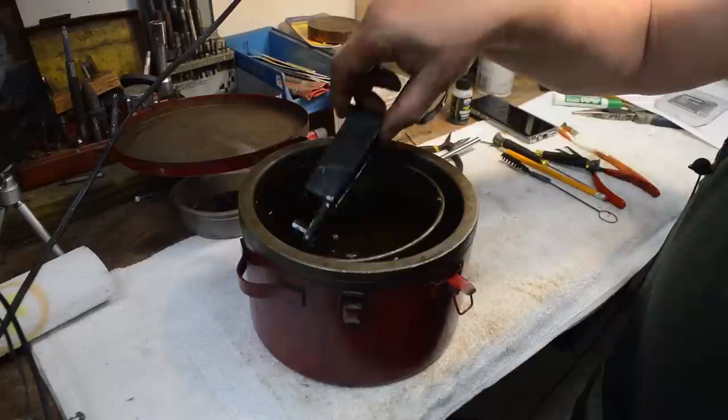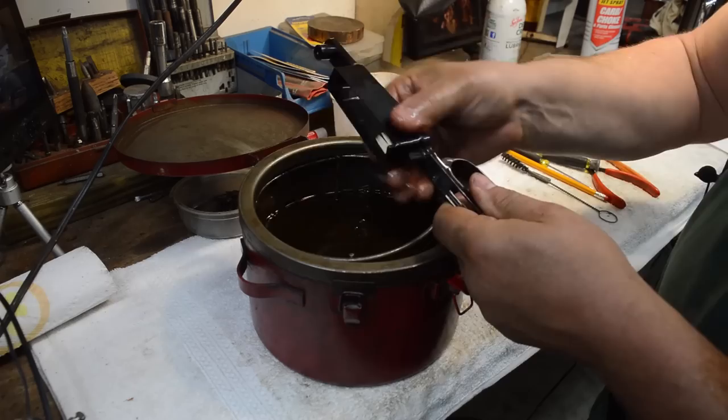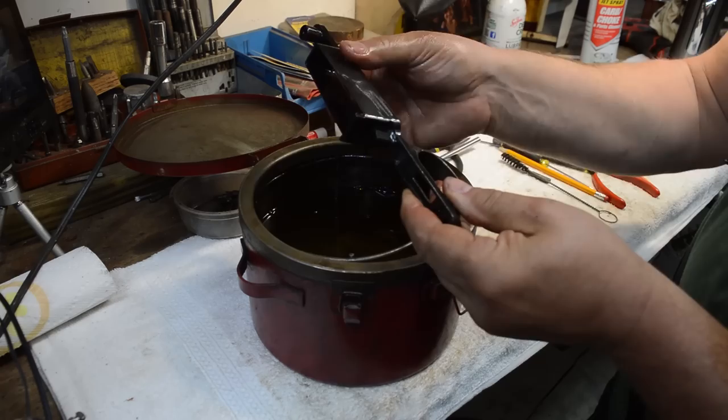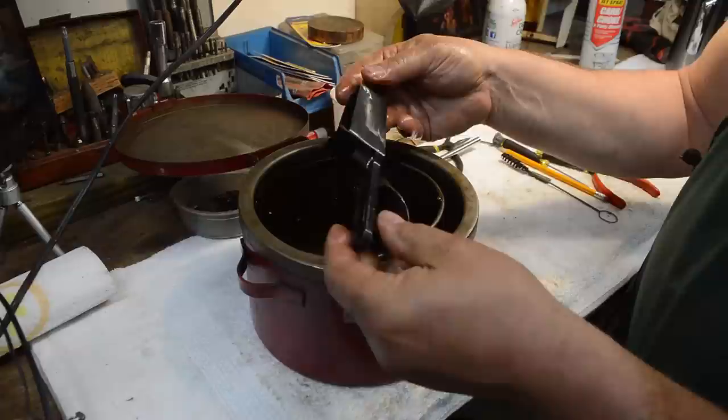You can put a layer of wax over this. Don't use gun oil at this point in the game. You've just spent all day trying to get this layer of rust on this thing, and if you use gun oil, it'll come right off in your hands. So don't do that for 2 to 3 days. Card it down, put a little bit of mineral oil on it. When you're all done, come back, and you wind up with this beautiful rust blue.